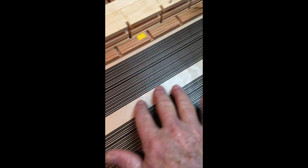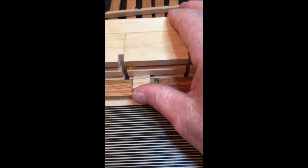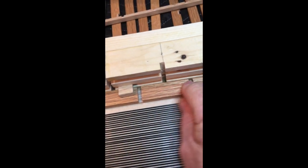Now I'm setting up the wooden lattice pieces in the jig. I've got wax paper down under the wires on the jig so that I don't bond my pieces to the jig. My jig has a lot of slots in it, which allows me to use little wooden wedges to secure the details into the jig. I can just push a wedge in there and now this piece is securely held in the jig and can't move.